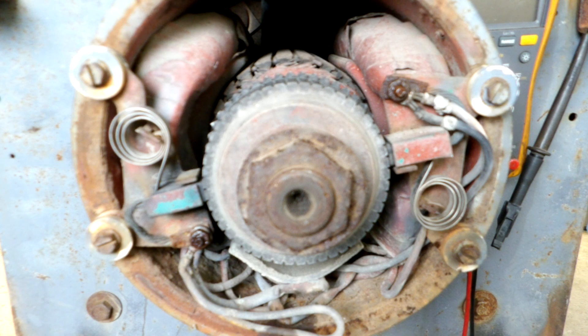I'm going to show everyone how to test these coils and determine if it's the coils or the armature itself. Testing the armature requires specialized equipment such as a growler, which induces a magnetic field into the windings so you can check for turn-to-turn shorts. You can also use a megger, which puts up to a thousand volts into the leads to test windings for short to ground, checking if the insulation is good. If either test fails, the armature will need to be replaced or sent out to be rewound.